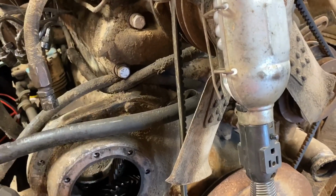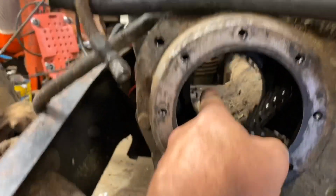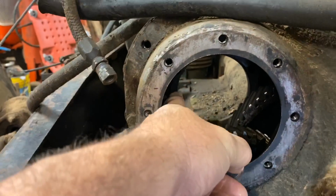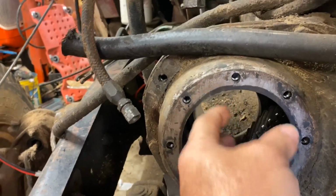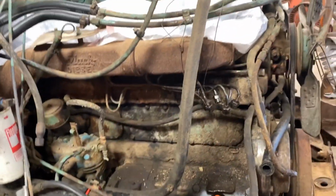And then we pulled the pump. We had to pull the radiator to get this cover off, to pull the gear. And the weirdest thing, the center of the shaft is way over here, and a coupling kept smacking. And you had to take the gear off. You couldn't just take the gear off of that taper. And anyway, so we've got the pump completely off.